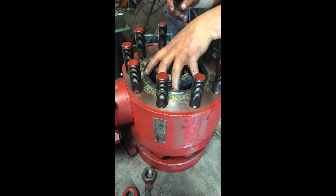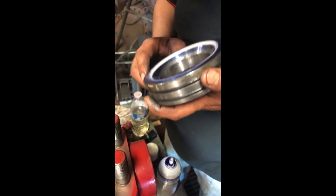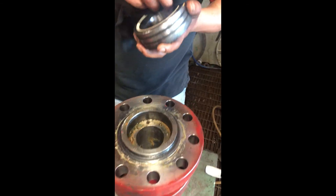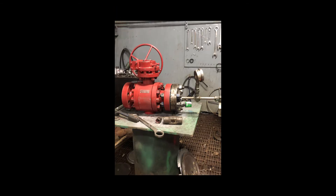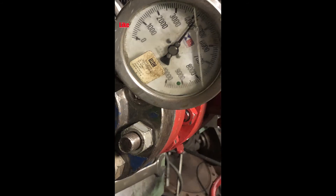You want to remove the seat and examine the insert. Spec the seat as needed. Clean and assemble the valve. We performed the lapping process twice for this seat. Now we clean it up and reassemble. Now we're going to perform the test. The valve passed the test after being lapped and it held full pressure.